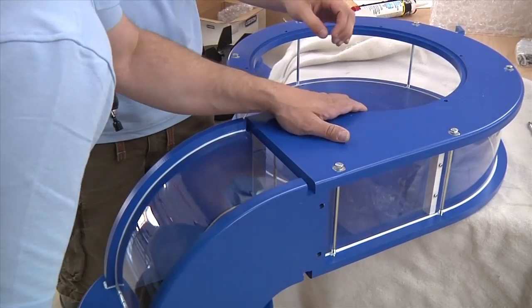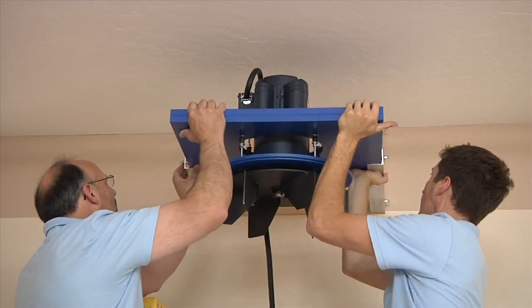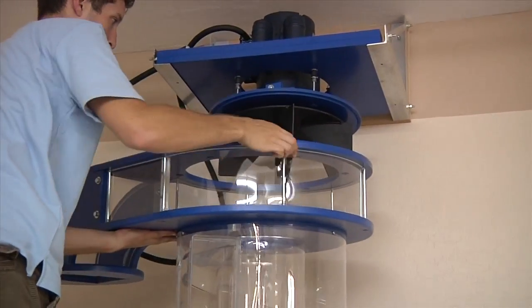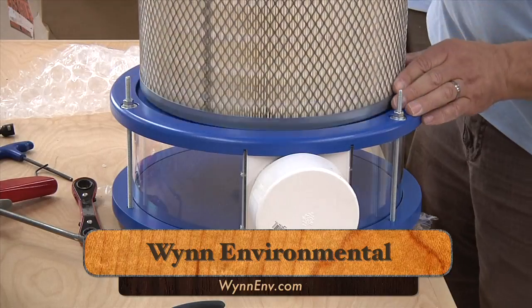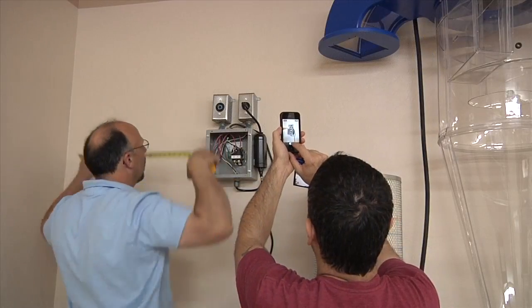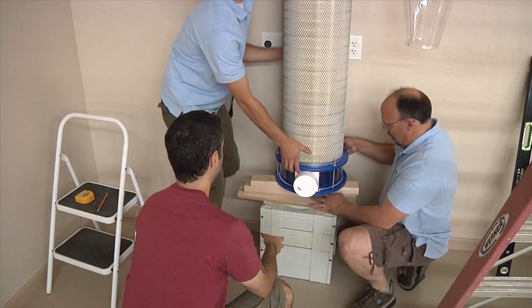The filter transition is then attached to the blower housing. The motor will hang on two aluminum brackets screwed directly into the studs on the wall. The motor is then lifted into place and slid onto the brackets. The cyclone and blower housing are lifted into place and secured with clips. For the filters, we'll be installing a double stack of filters from Wynn Environmental, which will feature a clean-out at the bottom of the stack. We are intentionally installing this unit higher than usual to accommodate a larger dustbin, and I'll build a permanent support for the filter later.